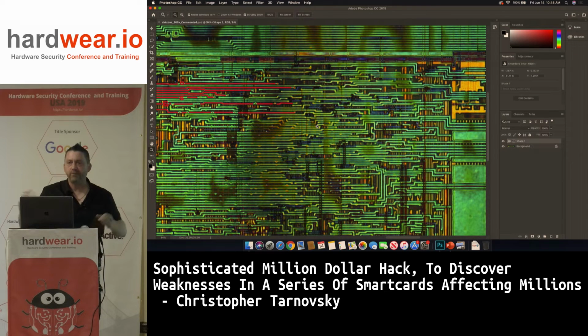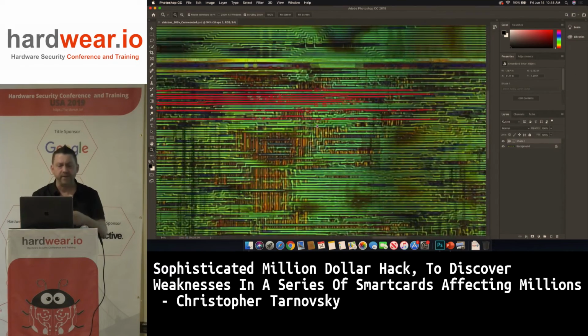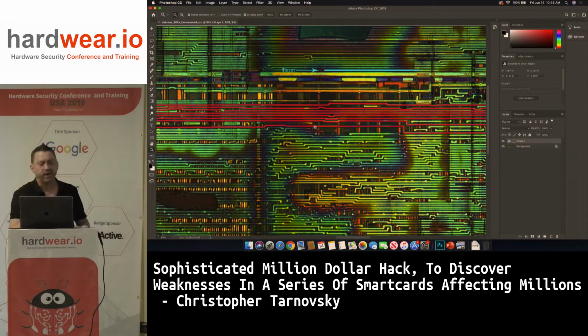So the flip-flops are frozen in time. So the flip-flops, instead of toggling for every instruction, they think it's still add or do this. But on this particular Infineon, rather than abuse the instruction latch, the instruction register, the clock line to it, I glitched on the data bus. So I actually glitched, and the data bus, Infineon is really bizarre. The data bus was 0 to 7. So this is 0 and that's 7.